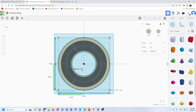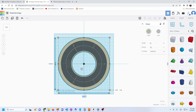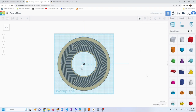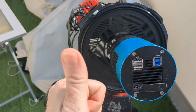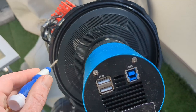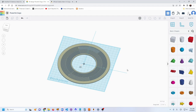Going back to the top view, I click the hamburger menu to center all dimensional operations to the ruler, then set both dimensions to 176 millimeters — exactly the diameter we used in the generator. Now we have the correct dimensions and could already export this as a file and print it. However, since there's nothing to grab onto, removing it from the telescope is difficult — I had to use a screwdriver — so let's add a handle shape.